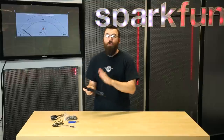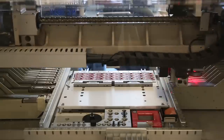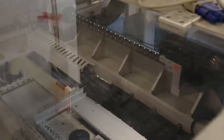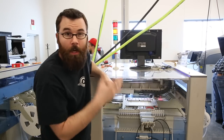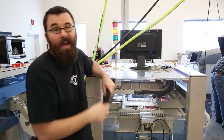It's a lot easier to show you what this does than to explain it, so let's go look at a couple of machines that have some cable carriers on them. You can see the cable track we're selling right here, and inside the machine you can see a bigger cable track on the top head of the machine. You can see that the bottom is affixed and the top is on the moving head, with all the wires moving through it.